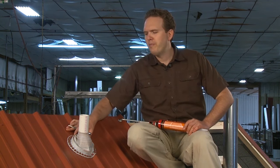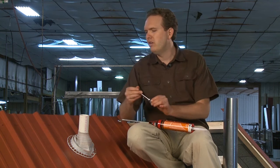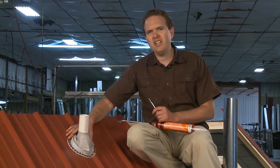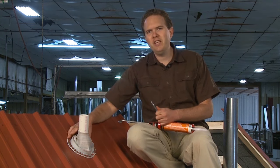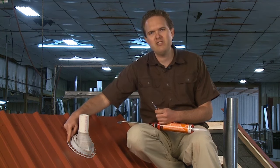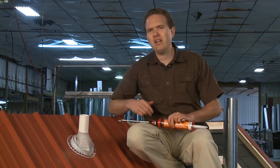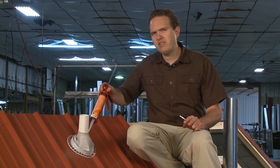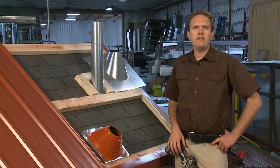All the screws are in and the pipe flashing is secured down. On a 10/12 roof it can be difficult to get screws in behind the pipe, but that's the most important place because that's where most water will come in. Using a drill extension keeps the drill higher and out of the way of the pipe, enabling you to get those screws in the back. If this looks like a lot of screws, trust me you really need to put this many in — the flashing tends to bubble up and fish-mouth between the screws, and putting them this close together keeps the flashing flat and tight against the metal panel all the way around. Since I started using this style of flashing I've virtually eliminated all the leaks around these types of pipes. For backup, apply sealant carefully all the way around the pipe, and you can also caulk around the top of the pipe where the flashing meets your PVC pipe.